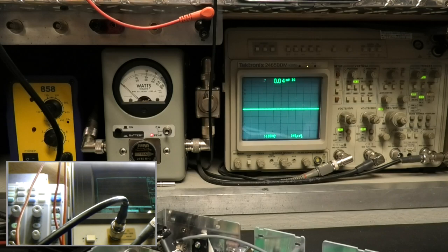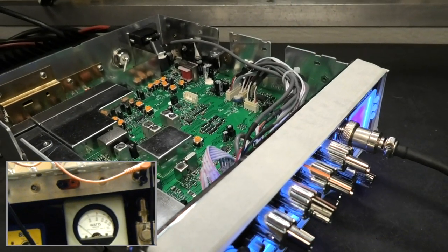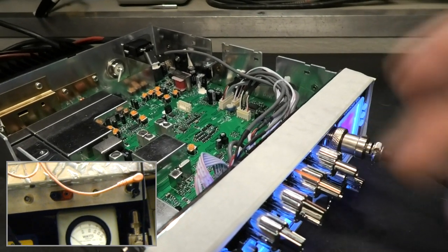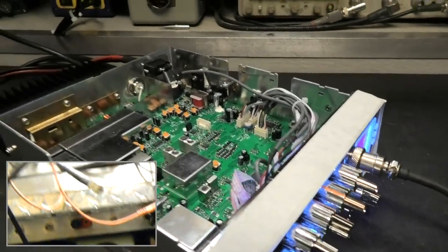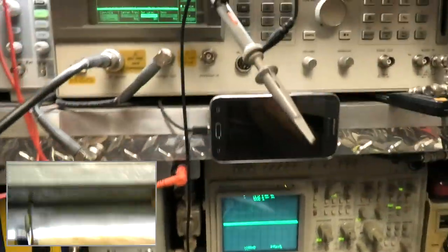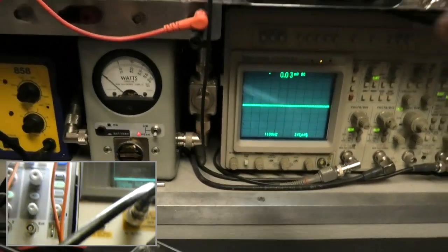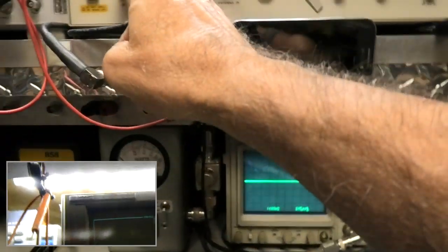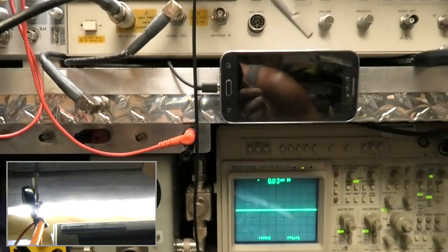We're gonna cover a few different things. This might be a long video. This radio, straight out of the box, converted only. That's it. It's the only thing that's been done. Converted, turned on, plugged in. We'll go to the scope here in a minute. But what I'm showing you right now is, as you can see, the radio is directly connected to the service monitor. There's no sampler, there's no meter, there's nothing but a piece of LMR 240 that I personally made all the connections with. Right? Yes, I'm a solderaholic. There we go.